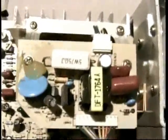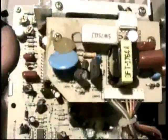Call up David Capron. I say, David, I got jail bars. I've replaced a bunch of capacitors, which is usually what it is. What is it? He said, it's D904 on the dynamic focus board. I go to the dynamic focus board, and I'm looking all over, and I don't see D904 anywhere. And I call him back, and I go, tell me again where that is. He says it's on that little dynamic focus board, underneath the blue capacitor. Oh, sorry. Yeah, there it is. With a ton of silicone on top of it. So that's a real common problem on these monitors.